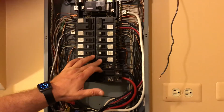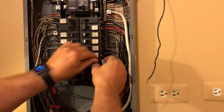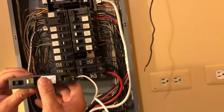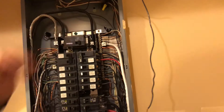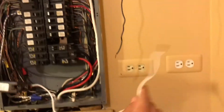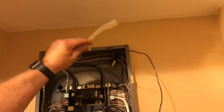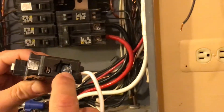Basically what you're going to have to do is identify which breaker it is, pop that breaker out and get it out of there. You'll see that the new breaker is quite a bit bigger, and it comes with this pigtail here. I've identified the circuit right here — I have the hot and the neutral. This pigtail is going to go to your neutral bar, which is right here in your panel. You'll be able to identify it by a white wire or you'll see the white wires going to it. The neutral from your branch circuit — the one going out to your receptacles or plugs in your room — is going to land on the silver screw here, and then your hot's going to go here. It's pretty straightforward.